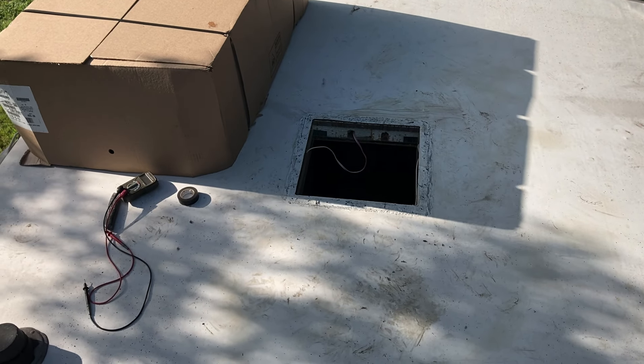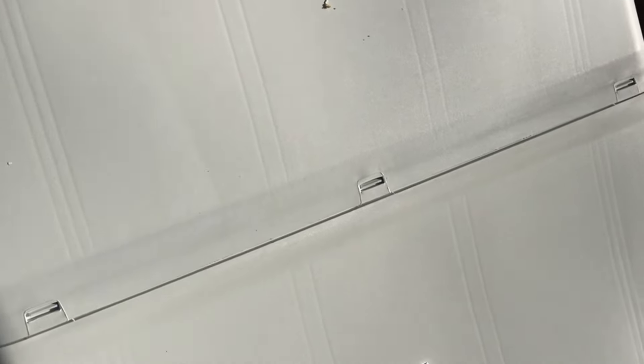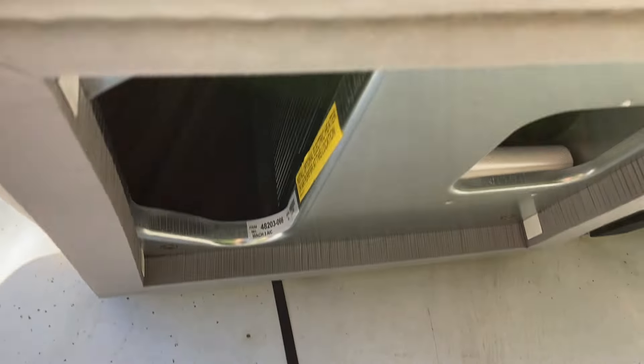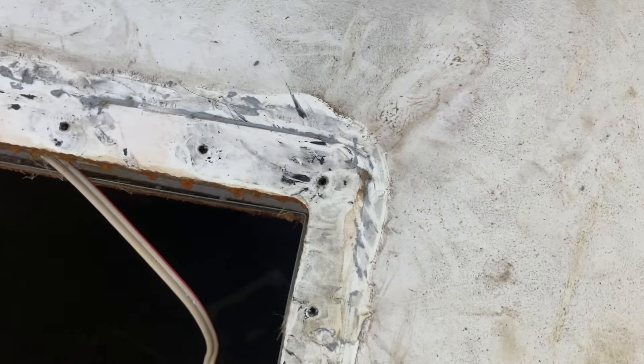It's all cleaned up around the side there. We're going to get her unboxed and dropped in. Now we're just going to whip it out of the box. This is the bottom side here, and you see this gray gasket. That is what we need to line up right over this hole. What this gasket is going to do is when we go inside and put the inner shroud on, it's going to sink this gray part all the way down, so it gets a good mesh and adhesiveness to the outer part of this skylight.